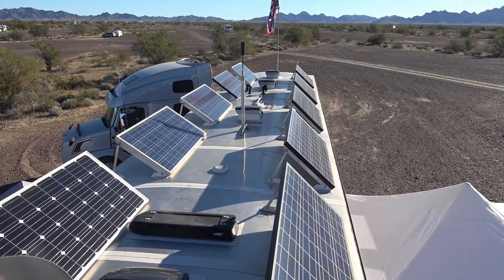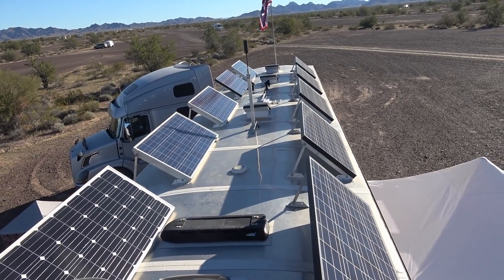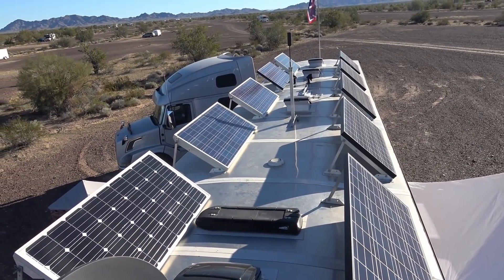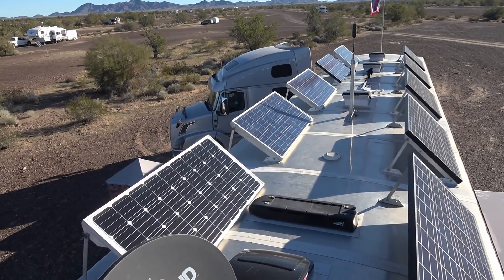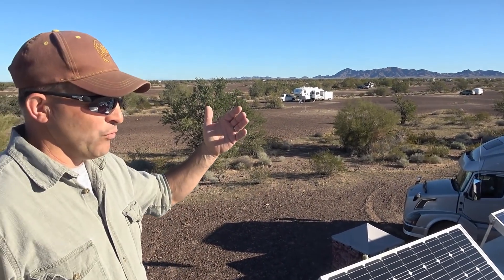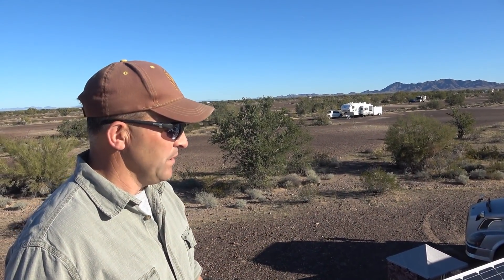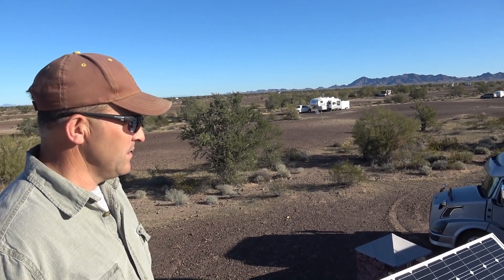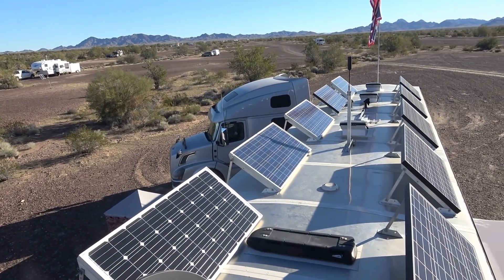This is our original solar array that was on our other camper. I kind of go along with the KISS principle — keep it simple. I just took what we had and put it back here. And I don't like higher voltage on DC until you get to the final use of it, because if you run it up to 48 to 100 volts DC and you get a wire that grounds out, you've got a potential fire. The risk goes way up with the voltage, and the benefit isn't really there for jacking it up that high.